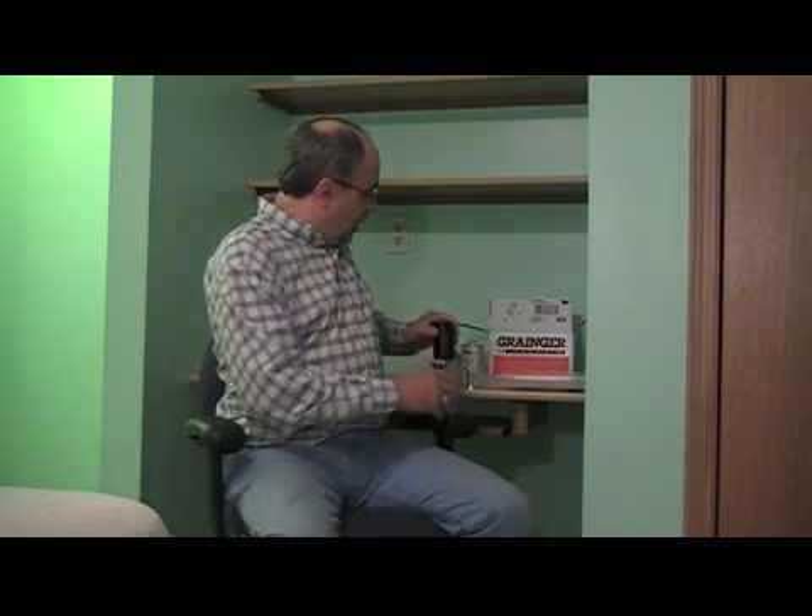Motors that have capacitors are on various equipment that uses single phase power. Typical applications include fans and blowers, compressors, AC units, and ceiling fans. When it comes to fans and blowers, those are typically going to use run capacitors — typically something like this one with two sets of terminals. It doesn't matter which terminals you connect to as long as they're on separate groups, since connecting both wires to the same group means they're on the same piece of foil, which won't accomplish anything.